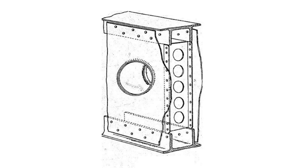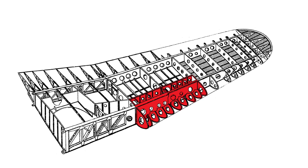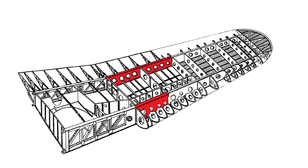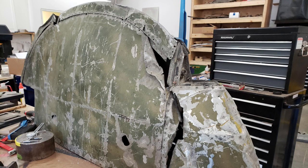At the dihedral joint on the Typhoon it switches to another double-T extruded boom upper and lower, but changes from the girder style to a double web style, and it's different for front and rear spars. The front spar's double section runs from the dihedral joint to about midway through the gun bay, because there's a sub spar just behind it running across the gun bay, creating what they call the torsion box — a very heavy structure designed to eliminate torsion in the wing. The rear spar carries out to the outside of the gun bay where it reduces to a much lighter single-T boom with a single web running up to the base of the wingtip, which is also built and bolted on separately.